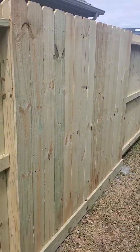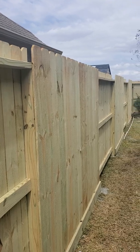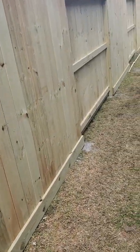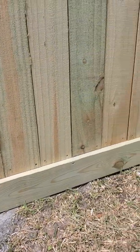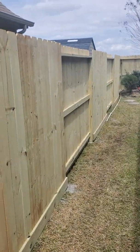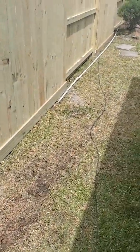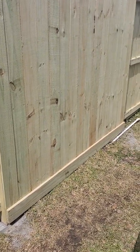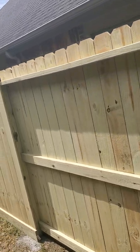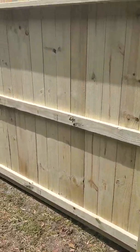And with that being said, when you don't put a rot board on a fence, it puts a lot of strain on that motor because the weight of those pickets is steady weighing down on those runners, those 2x4s. So over time, that's why you see them warping, bending, stuff like that. You put that rot board on there, those pickets set on that rot board, and that rot board takes the weight of the whole fence. Therefore, it takes all the strain off the motor of that fence. There's no strain on that motor whatsoever. That rot board is carrying all the weight. It's the horse. So, in my opinion, it's just my opinion, you can take it how you want, building a fence without a rot board is like driving your car without oil. Puts too much strain on that fence and it ain't gonna last near as long as having a rot board on it. And it don't cost that much more to get that rot board.